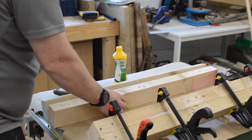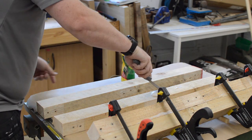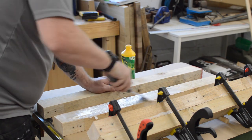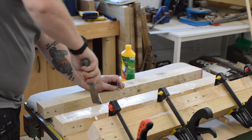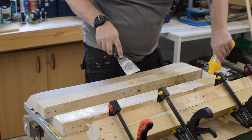Okay, the first task after all the cutting is to assemble the 2 feet. These are basically two 32 inch pieces of 3x2, which are very messily sandwiched together with glue and a couple of screws, and we repeat that for both the feet.